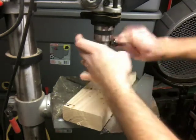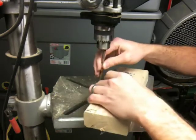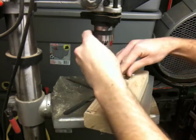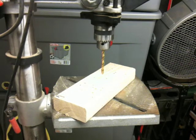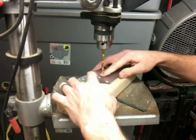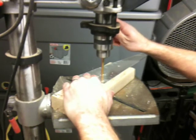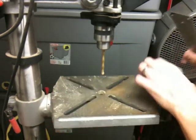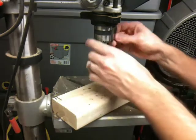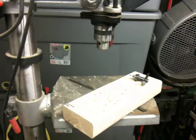I'm going to replace my bit with my quarter inch bit here and double check on the plans which one is supposed to be the quarter inch. This is the quarter inch hole, so I'm going to go ahead and line it up before I start the press and there we go. I got my quarter inch hole and I'm going to replace this bit with the five sixteenths for the other corner flange. It's a pretty decent sized hole.